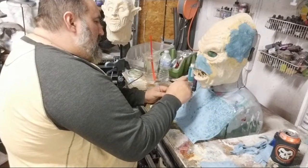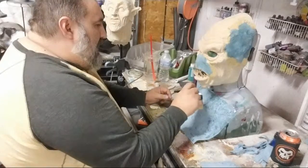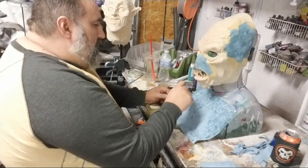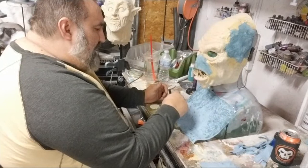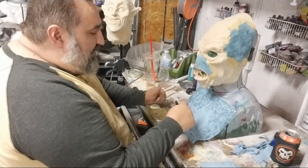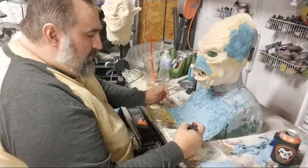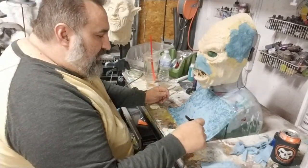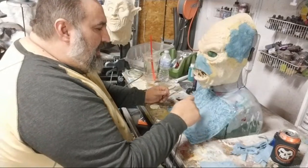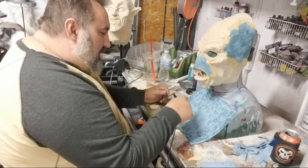Now, contact cement is not the fastest in the world. If I use a spray adhesive, Super 77 from 3M, this would be a faster process of building up and drying. However, it would break down a lot faster because the Super 77 isn't very heat tolerant, and the contact cement can take heat a lot better.